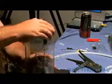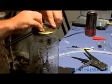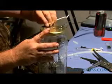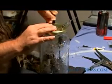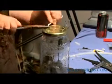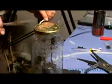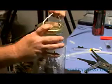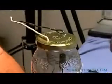It can be a little tricky. You have to go back and forth, bending wires, adjusting, readjusting, and eventually you will find the sweet spot for the wires, the fuel cell, and the nature of the solid copper wire makes it very durable once you reach this spot. You do want to put a little altitude between the wire and the top of the lid. This allows us to put some sealing putty in here to make sure that it always has a vacuum-proof seal. We finally got it together, and this is going to do an awesome job for us.